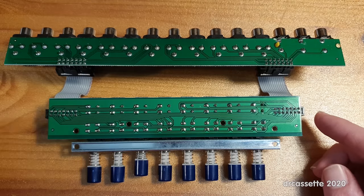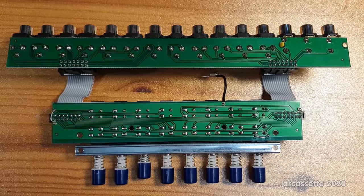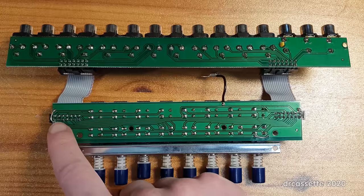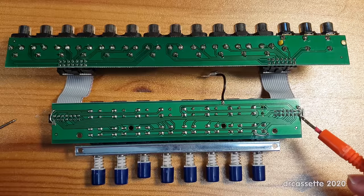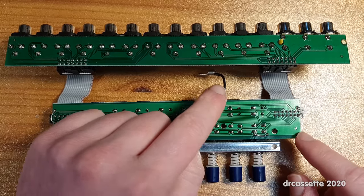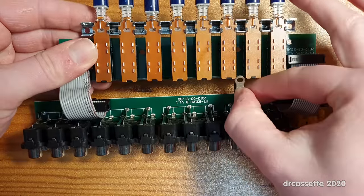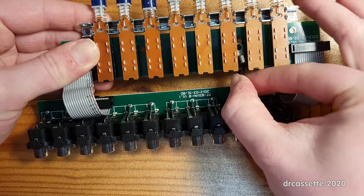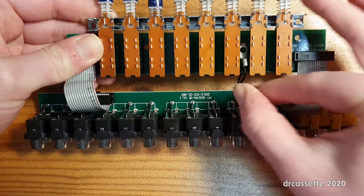That's a bad design and I'm going to change that. That didn't take long — I redid the solder joints and modified the circuit board. We now have a connection here, here, and here. If I now measure from where there used to be the only ground point on this board to over here, I get a connection. I've also added a wire here that connects to a screw terminal, and I can feed it through under the switches to the screw hole, which is going to ground the case once everything is put back together.